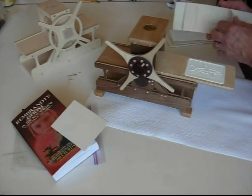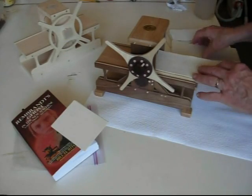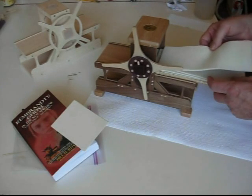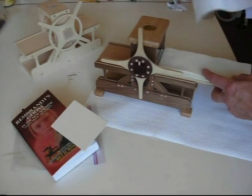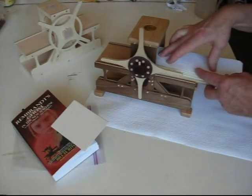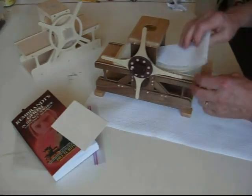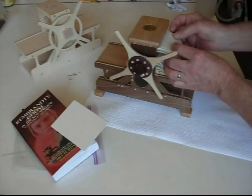We provide several kinds of felt to give it some pressure, to give it some embossing power, and depending on how thick the plate is and how high the roller is, we use two or three of these felts. On top of them, we put a piece of vinyl. The vinyl also gives it some gripping power. I test it for the pressure — seems to be about right. I like to fold those felts back out of my way.